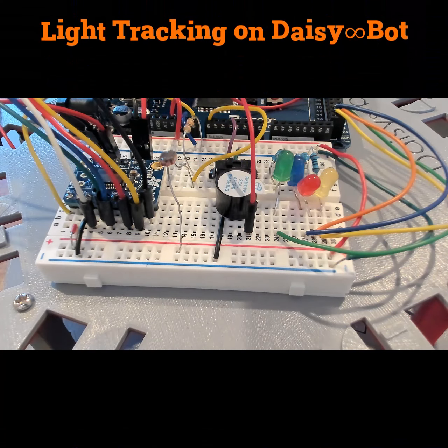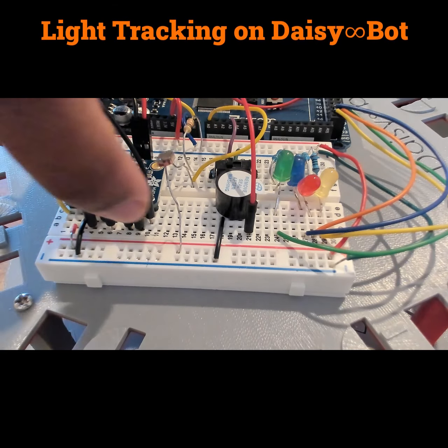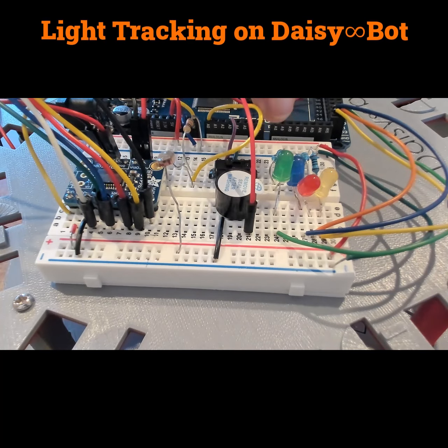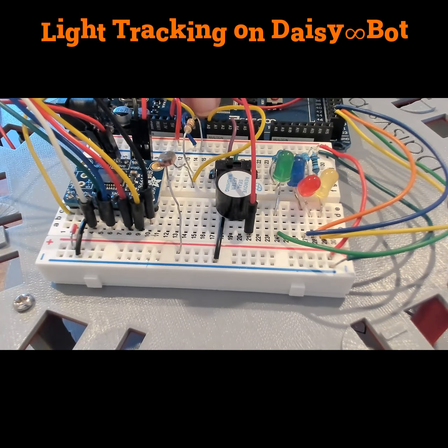So here's the photoresistor wired to our breadboard. So here's the motor controller, the photoresistor going to 5 volts, the 10 kilo ohm resistor going to ground, and then this yellow wire that comes from the meeting point between those two that goes to A0.